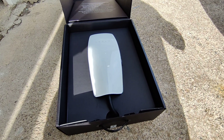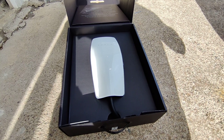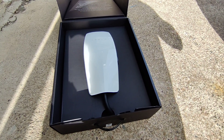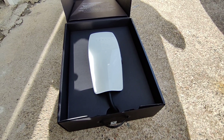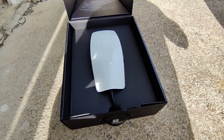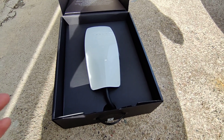For example, our house only has 25 ampere fuses. We could upgrade those, but most likely I will just run this as an 11 kilowatt charger. If you compare this to other 22 kilowatt chargers, I think this is pretty much the cheapest quality product you can get.